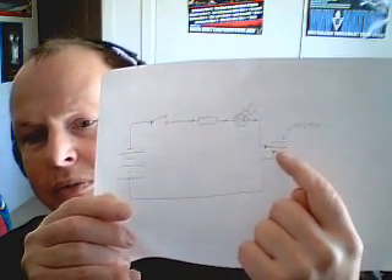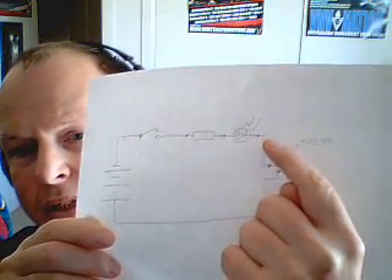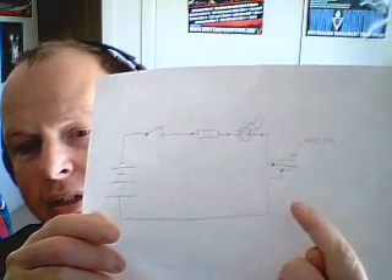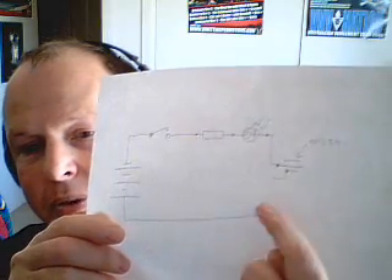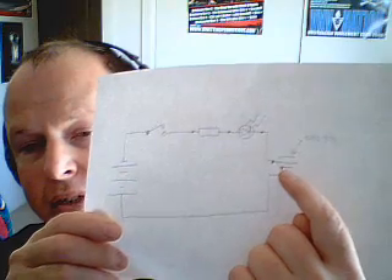What I've done — you can do it either way — but I've put the lead coming from the LED to the centre of the SO239, and the other lead goes to the outer of the SO239. To do that, I found it easier to come through that black thing there — that's a wire coming from the inside — and it just screws down under the screw of the SO239.